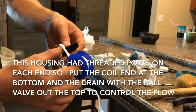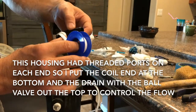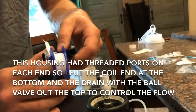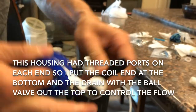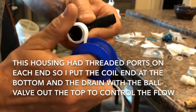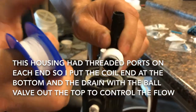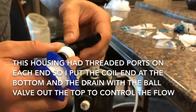When you're doing plumbing tape, if you put it in your right hand with the threads facing you, set it on and then wrap it around - you can go really fast and thread it really well - and then you can snap it off like that, which makes it a heck of a lot easier.